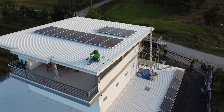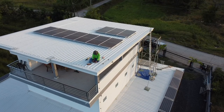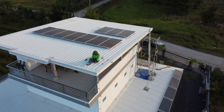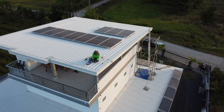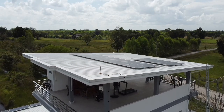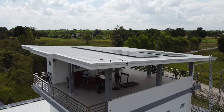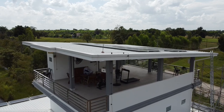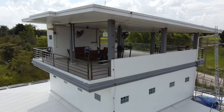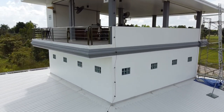On the roof, a technician has fitted insulated feet to the steel roof. He is then able to attach the lightning conductor to these feet and not to the steel roof directly, and so the system is complete. A bare copper cable of the appropriate resistance is attached to the lightning conductor, then passes through a series of ceramic lightning rod insulators to ensure that the cable does not touch the building.